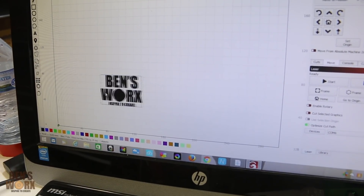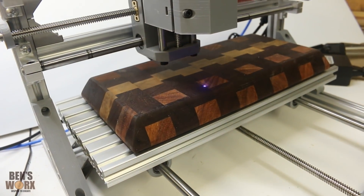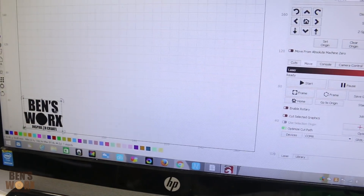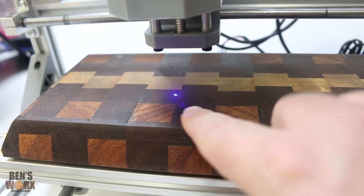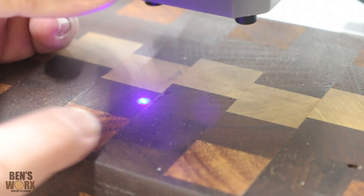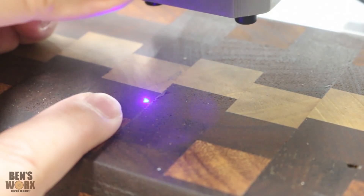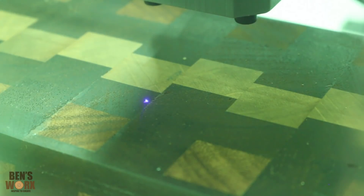Once you've got your size worked out, you can drag it around your workpiece. If I put it down in the bottom corner and click the frame button, it'll actually show me where it's going to engrave. Because I want my engraving done in the middle, I'm going to move it across and up slightly. Now that you've got your position worked out, the next step is to adjust your laser beam — you want to get the point as sharp as possible. You can adjust that by turning the focal knob underneath. You can see there it's clearly out of focus, but once I turn the dial I can get it to become nice and sharp. If you look through these laser safety glasses, you can see it's a fine point.